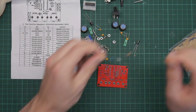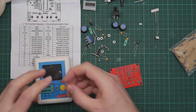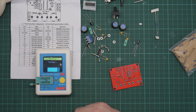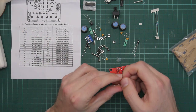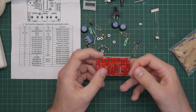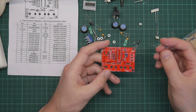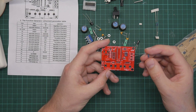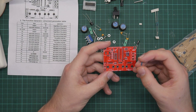Okay, now we just need to do the other three resistors. So the backstory behind this, let me actually just double check the resistance. Is I was working on the flux engine and I was having some difficulty, 5.1K, good, with the clock rate. And I was worried that the clock in the microcontroller board the flux engine is based around was wrong, because it's based on an RC oscillator internally and they're not very good. It's supposed to lock onto the USB signal, but I was worried it wasn't actually working.